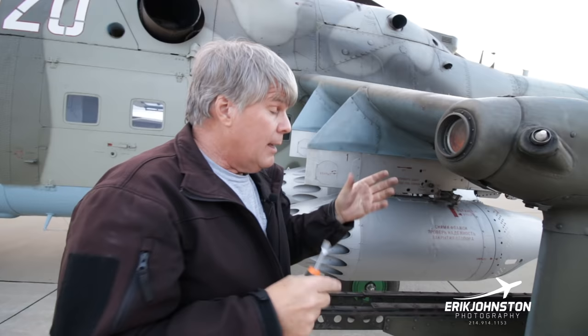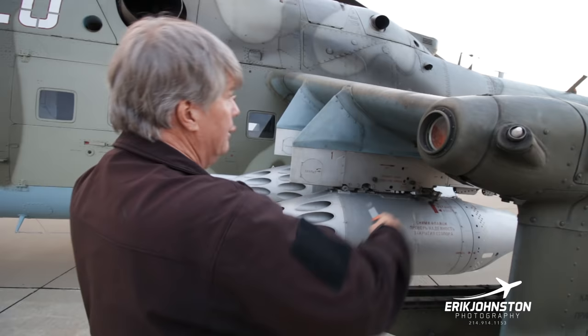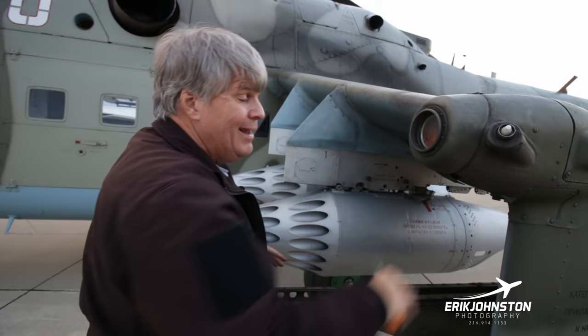I will tell you, we talked earlier about this GoPro and the heat problem. You put this right here and you can see all the carbon. What does that indicate? Exhaust, yep, we're getting direct heat downflow. Whenever this is lifted up and we're in flight, nose is low, we're getting heat right across here. This GoPro doesn't stay on for more than 10 minutes, it seems, once we're in flight.